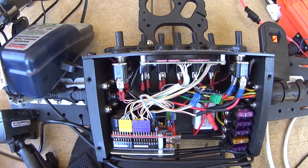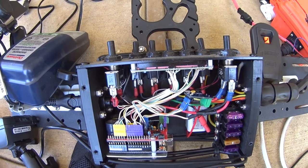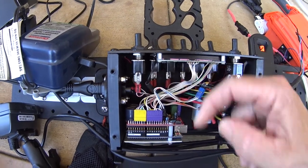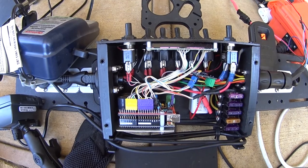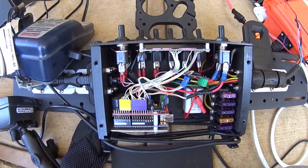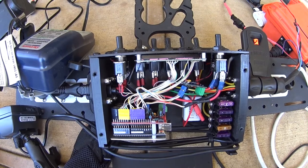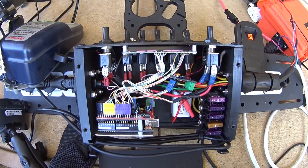In addition, there's a power fail circuit that detects when power is failing, and some large capacitors designed to keep the computer running in the event of a power failure long enough for the current value of the charge counter being decremented to be stored back into EEPROM before power runs out.